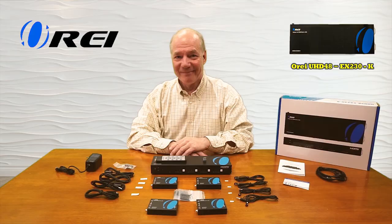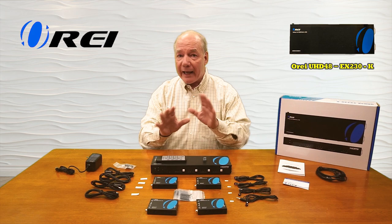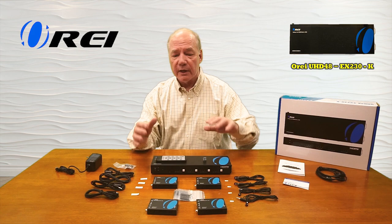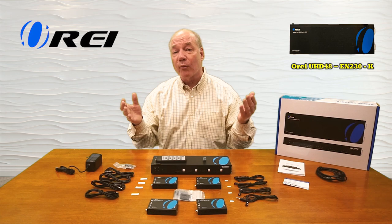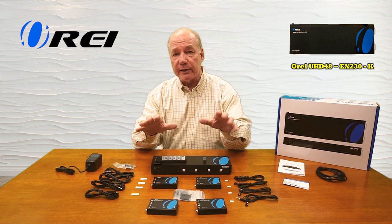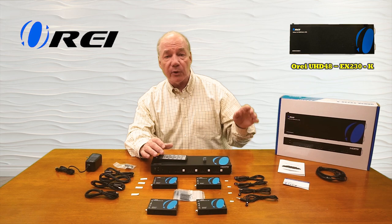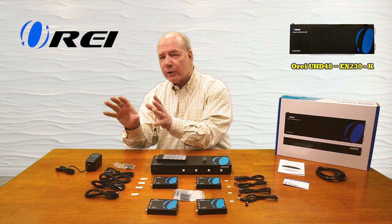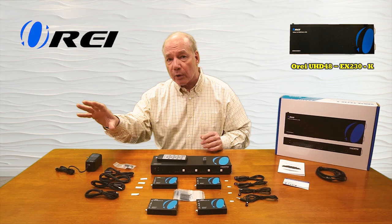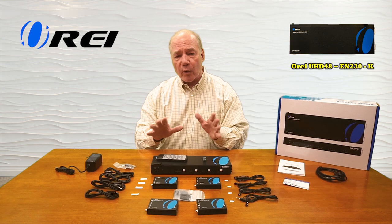I hope you found this overview of the UHD48-EX230-K 4x4 HDMI matrix helpful. It provides an incredibly easy way to share HDMI media content from four different devices to four remote locations in full 4K ultra high definition over a single Cat 6 cable up to 70 meters away. Local loopback lets you enjoy the content at the primary location while broadcasting to secondary locations. As a matrix you have complete control over content distribution via the infrared remote, front buttons, or software. Infrared blaster kits collect remote control signals from remote locations and send them back over the same LAN connection, and power over cable means one power supply operates the entire solution. Everything you need is included and with a few simple connections you can be up and running in no time.